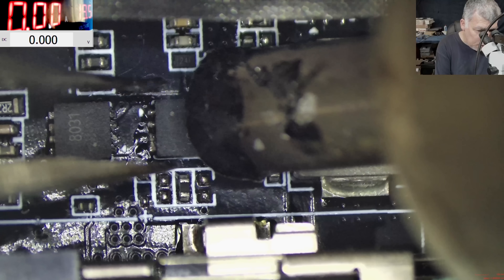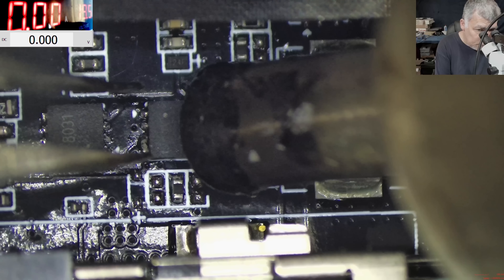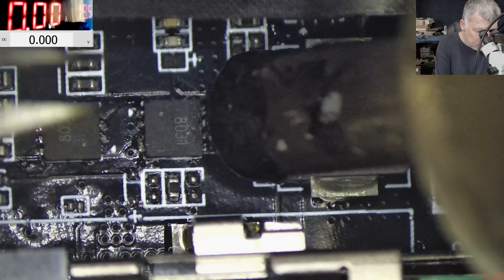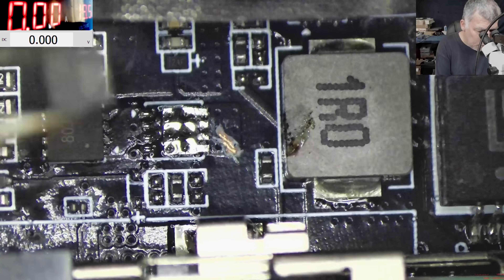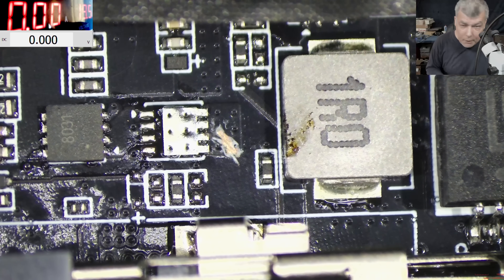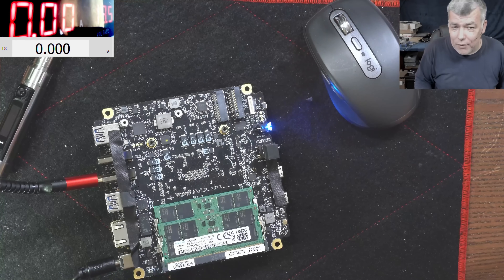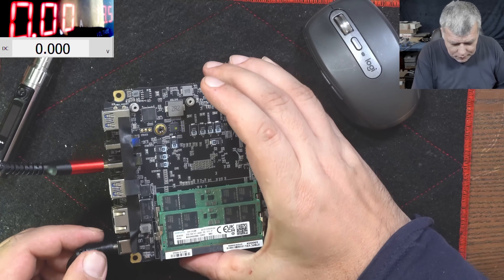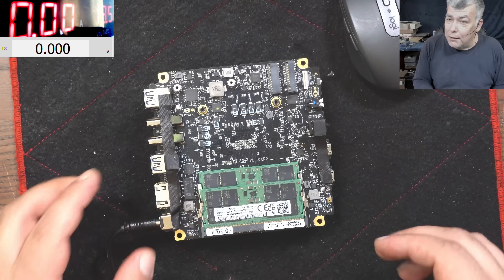This is a P-channel MOSFET. Okay, so we remove the MOSFET. Let me grab another MOSFET. And — tada! I have a picture; you can see the BIOS menu. So everything is working fine and great. A shorted MOSFET and a shorted capacitor — it's not a big deal.